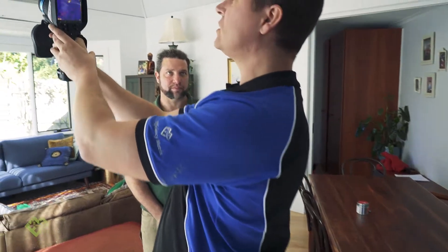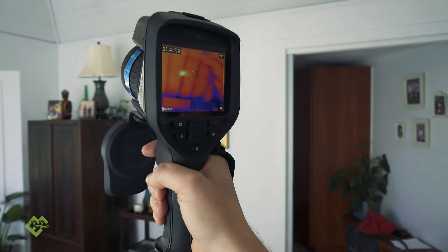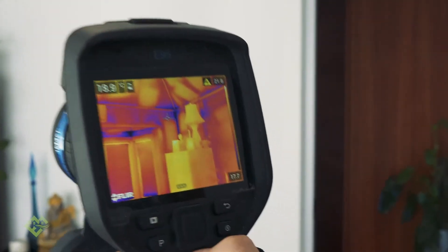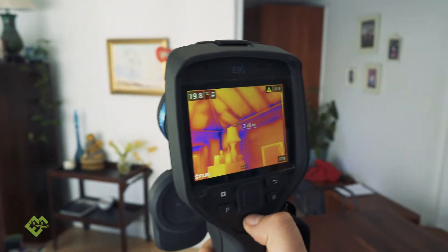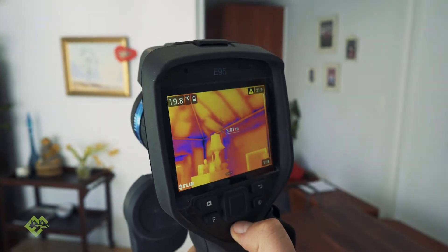The insulation here looks great — you've done good work Uncle Jojo. There are a couple of little gaps around — look at that, how much is leaking through the corners! You've got a beam going through here, so that's pretty tough to insulate. You can clearly see the form of the batts here, and look — it's even crooked with a big gap in between. This is even more reason why you need to make sure that when you're installing your batts, you're putting them in nice and neat and together.